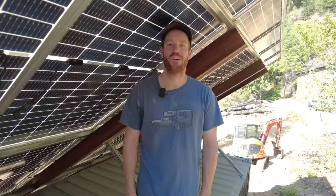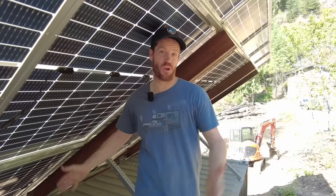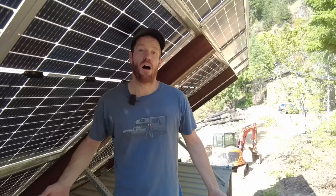We've had a lot of questions about concerns with wind loading on this array and the way we installed this container, and I've had the same concerns. I've run some wind calculations and I'm not worried at all about wind from the south, but with a big enough windstorm from the north, we could have some damage. Our plan is to add some heavy guy wires that anchor the container back into the hillside to keep it from being blown off the hill.